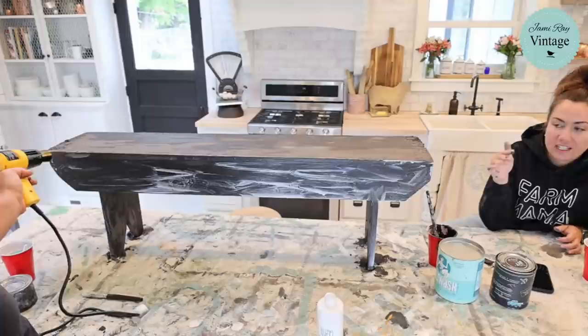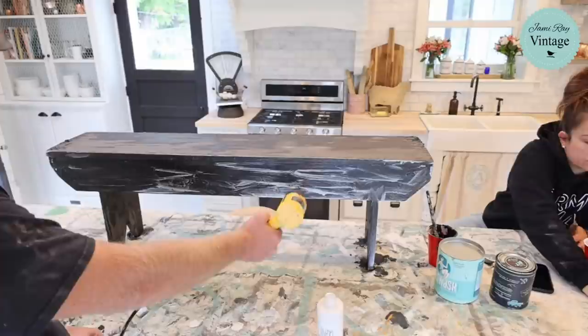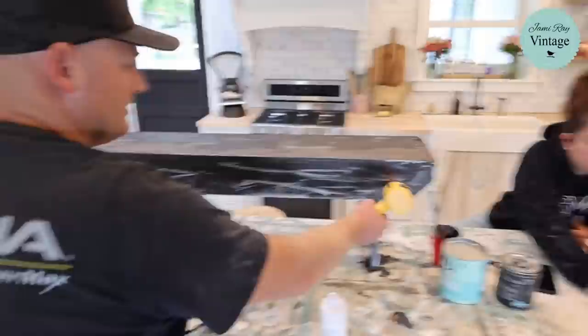This might be interesting because even though I'm getting the top layer dry-ish, it's not going to be all the way dry when we start putting paint on. A tip: if you go really thick with your sealer you can get white spots like this, so go thin coats — lots of thin coats when putting sealer on something like a tabletop or side table. Caitlin dropped the DIY basics video link.